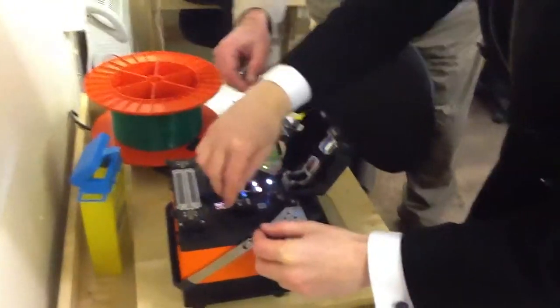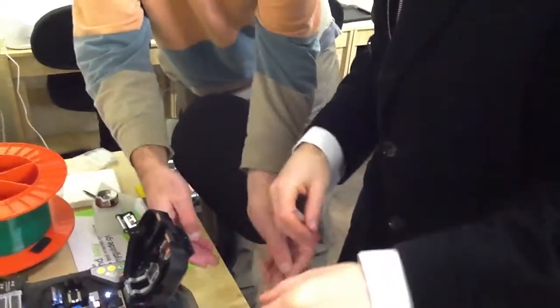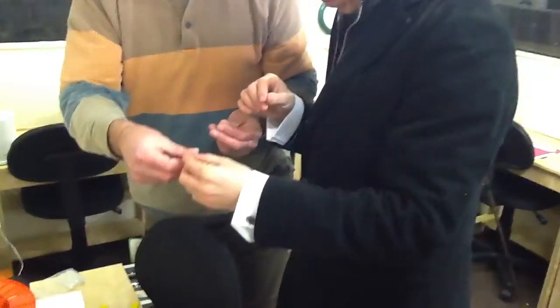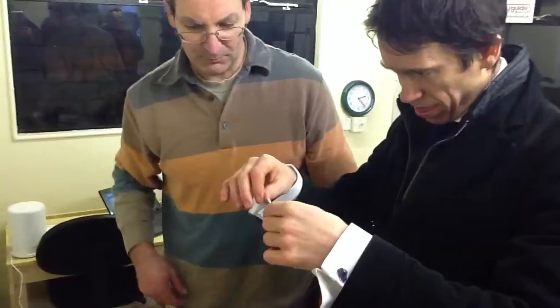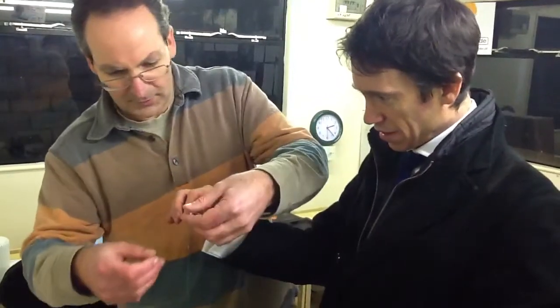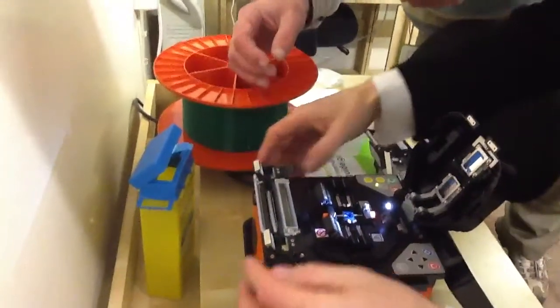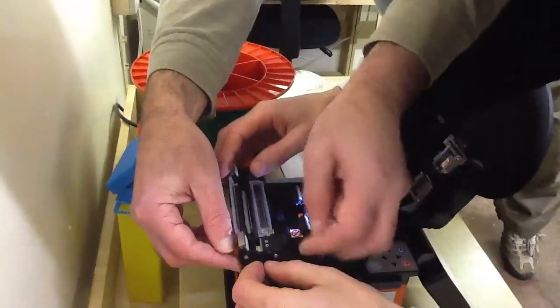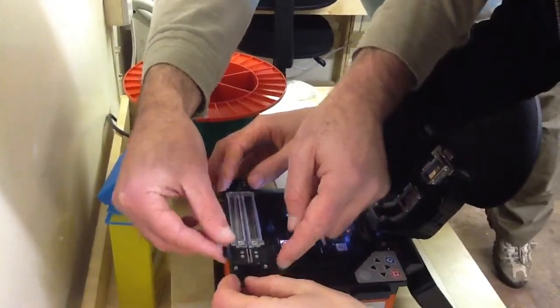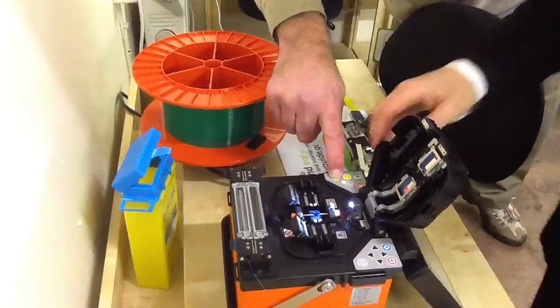What do we do now? Open that flat — that's a bit of fibre, and you can feel it's reasonably strong. We've got this heat shrink here, positioned over the bit we've joined. Part of what that does is protect the splice. There are two ovens on this one — open up one of the ovens and lower that in. This is called heat shrinking. Press that to shrink it down.